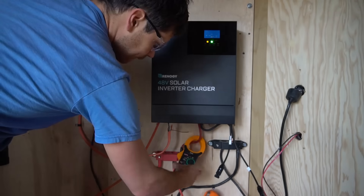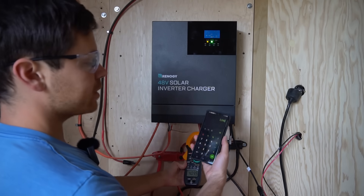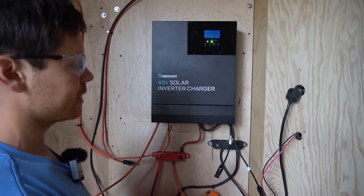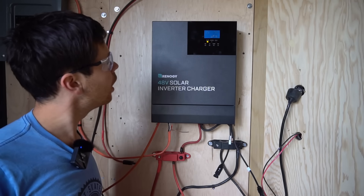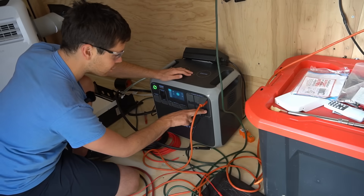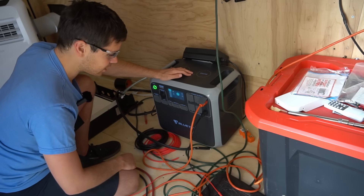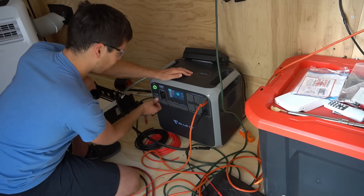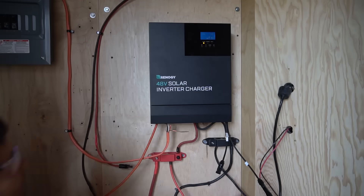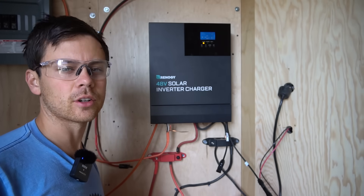Let's try to charge it with AC power. We've got 40 amps going into the battery — 40 times 51.2 volts is 2048 watts of charging power. That's pretty impressive for the size of this system, though pretty standard for these all-in-one units. The AC charger tripped the 2000-watt over-current protection on the AC 200P solar generator. I guess we were slightly over that, so let's lower it to 35 amps instead of 40. Now we are charging again and it should be able to charge indefinitely at this speed.